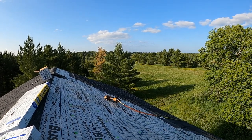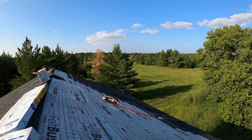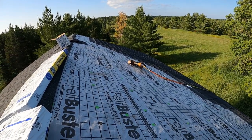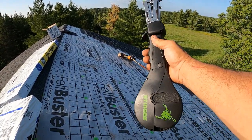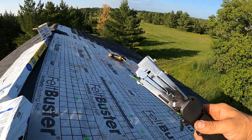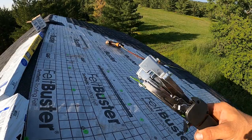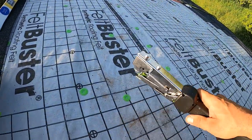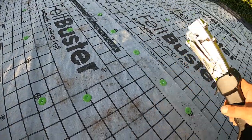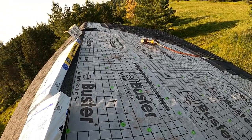I made it to the roof and I've got to get it done today because tomorrow's supposed to be in the 90s and there's no way I'm going up on the roof in that heat. I got the underlayment down using a Stinger cap stapler from Menards — it's like a hammer stapler. The thing has worked flawlessly. You smack it down, a little trigger pulls up another cap, works perfect.